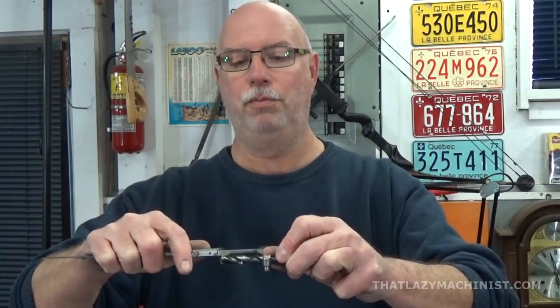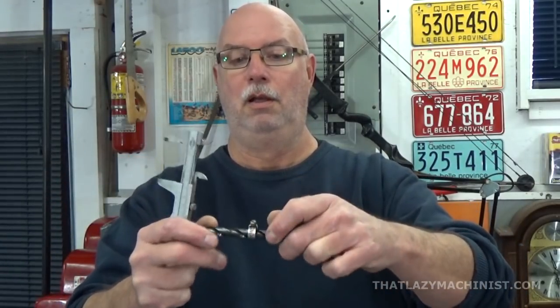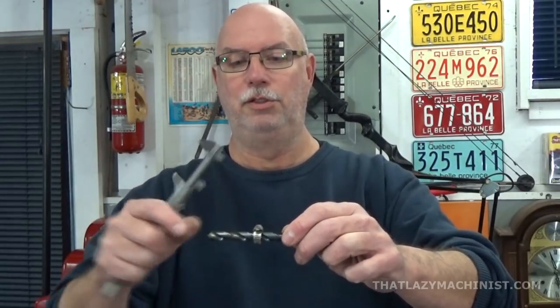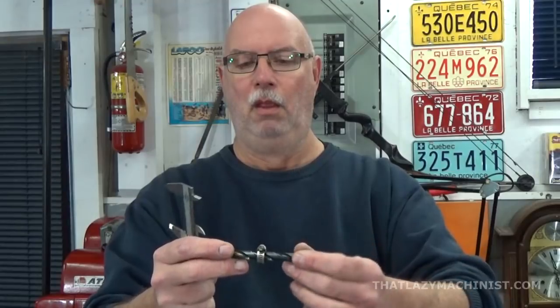And if I put myself here, I can see that I've positioned a little hose clamp on my drill, just positioned a little bit further away from the start point of the major diameter than I have on my calipers by eye. I'm talking maybe 15 thou further away.